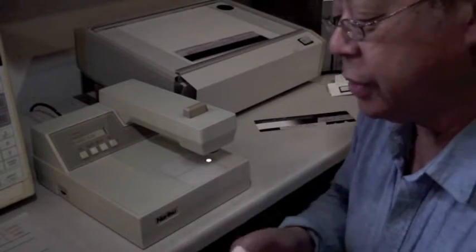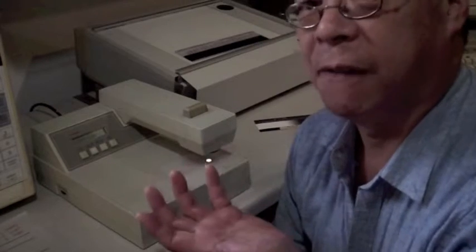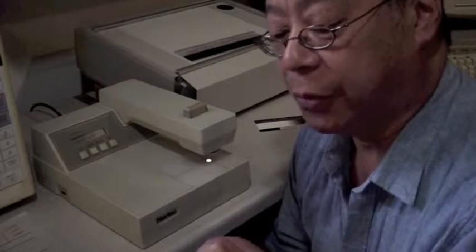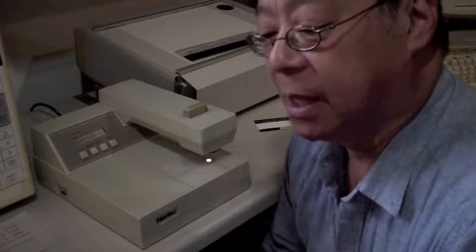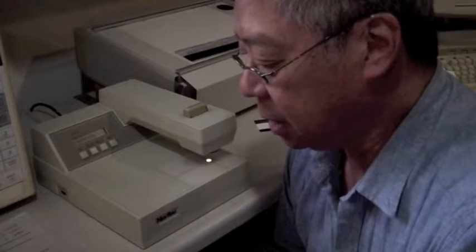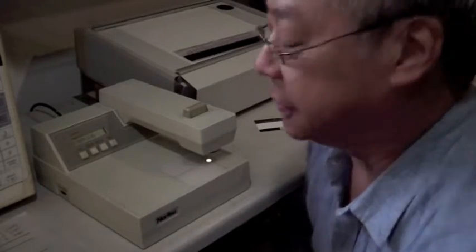So what it's doing, again, is shining a light down onto the material and capturing the light that's reflected off, and then giving you a numeric value where 0.30 equals one stop. If all the light was collected, it would read 0.00, but since all materials absorb some of the light, you never get pure white on any reflection material. When you use a densitometer for transmission, then it measures light going through the material, and that's the difference, okay?